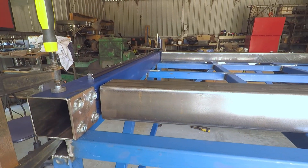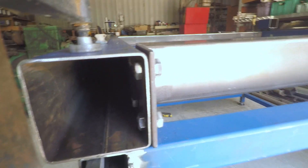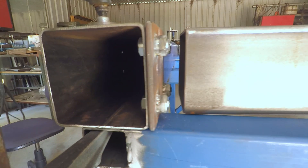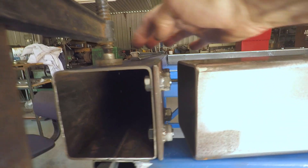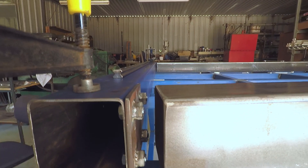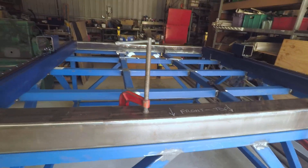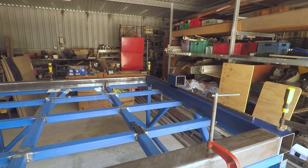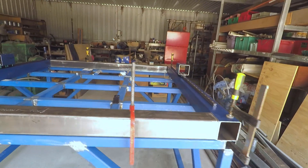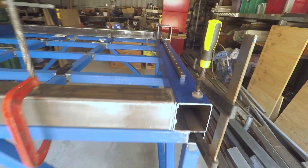Now that I've cut the front and rear cross members to size, what I've done is made a plate, welded the nuts on one side of the plate, and drilled through the side of both Y rails. I've moved the Y rail back into line, flushed both sides, and I'm going to weld this plate to the edge of the cross member. I've fitted both cross members in place, clamped them, clamped the two Y rails, measured the diagonals — the diagonals are within inside a millimetre of each other, so I'm very pleased with that.